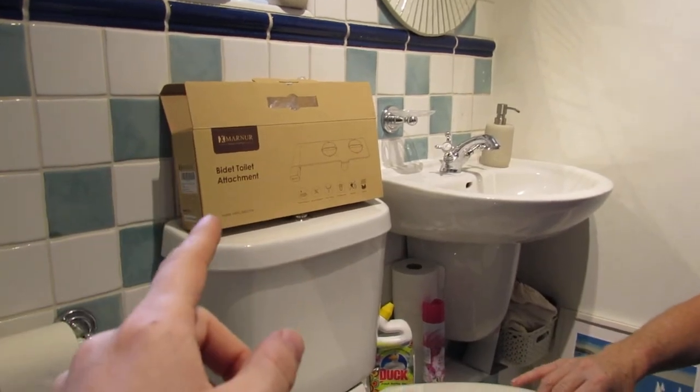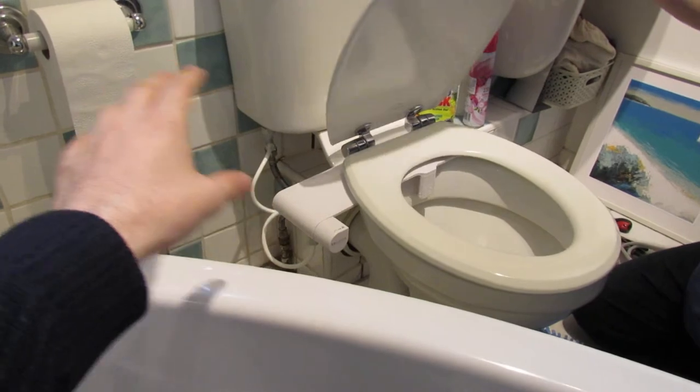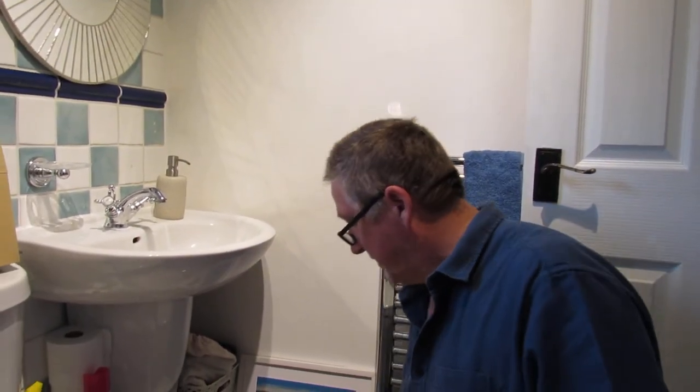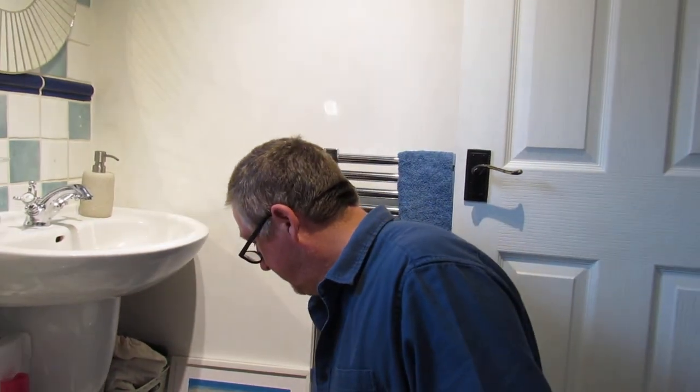If this just helps you along, saves some toilet paper, and is more environmentally friendly, please subscribe to our channel. We'll put a link to this product in the description. As we always say, if you're thinking about buying this product and wondering about the quality, ease of fitting, how it operates, and how it looks - we hope our video is helpful. It's quite smart and stylish and as good as the most expensive ones. I can't stress enough: buy some thread sealant - it's six or seven pounds, just a belt-and-braces approach. If you haven't got a pipe cutter, a sharp utility knife will do, but be careful and take your time - it needs to be a straight, level cut. Don't forget to isolate your water supply. Thanks for watching - and well done to the manufacturer.